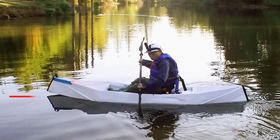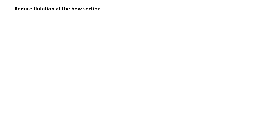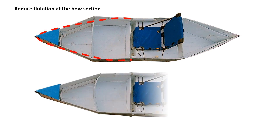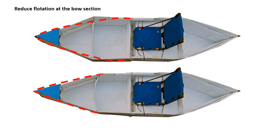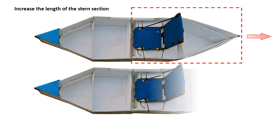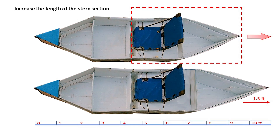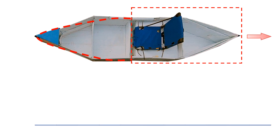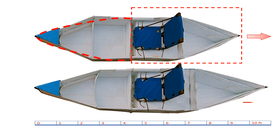The lift at the bow is too much and I have to fix that. I cannot move my seat forward to change the weight distribution on the kayak, but I can push the bow section together to reduce the buoyancy at the bow. I can apply heat to the hull first to change the shape and at the same time make it more hydrodynamic. Another option is to lengthen the stern section so I can move the seat a bit backward — the kayak will then be longer and should be faster too. If I build this boat again, I can combine both changes: compress the bow section to make it narrower, and lengthen the stern section. This will create a better kayak.